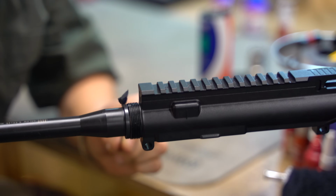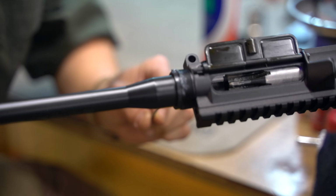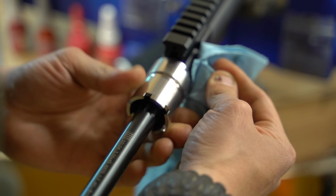It was really cool watching this gun come together and honestly getting the why behind some things that even if I intuitively knew, I'd never really articulated even just to myself. By way of example, there with the armorer putting this gun together, he's explaining to me the go, no-go for magazine release, assembling the lower receiver. You take the button, spring, magazine catch, you thread that thing on, boom, done, moving on. Yes, but why are we doing what we're doing, and what are we actually looking to achieve with that? Yes, you obviously want to make sure it catches the magazine and releases the magazine.